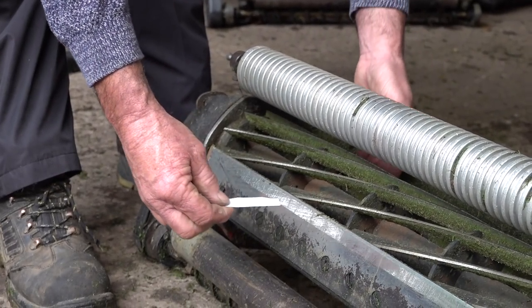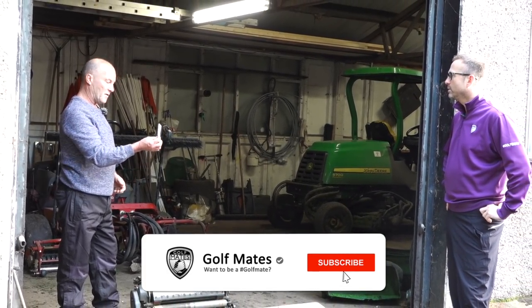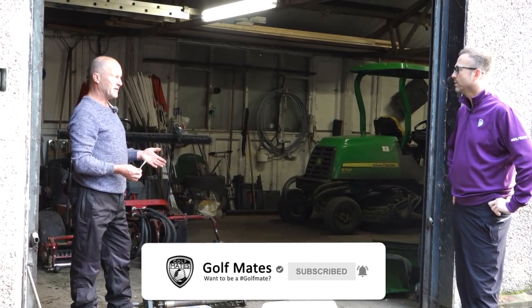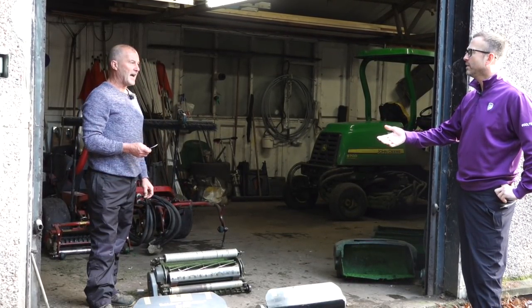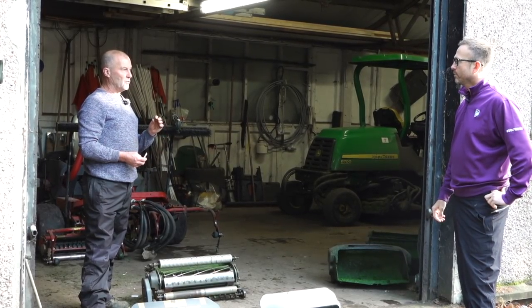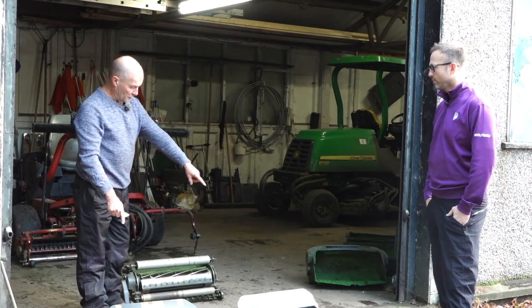Look at that — that's sharp. Now all the golf mates watching this video will have mowers. What you want to do is make sure you've always got your blades set nice and sharp like that. You want to be raising the cut for winter, so from 3mm it's going to get raised to 5mm. The reason is just to leave a bit more grass on the greens, keep them a little healthier and give a buffer, so they'll still roll nice and smooth.